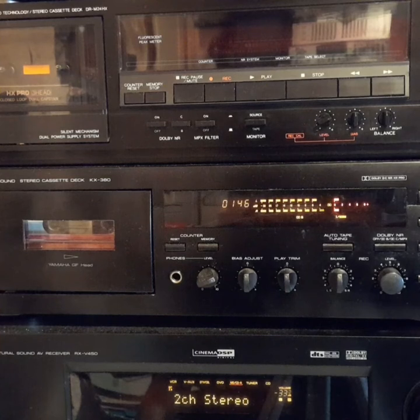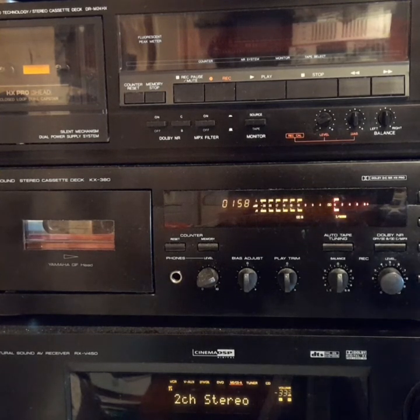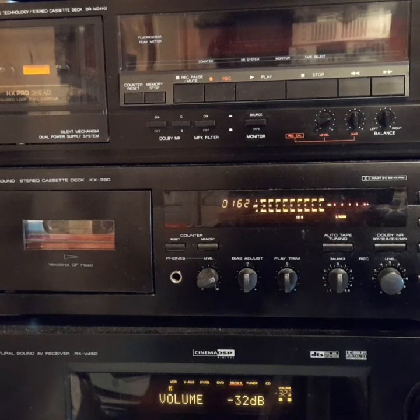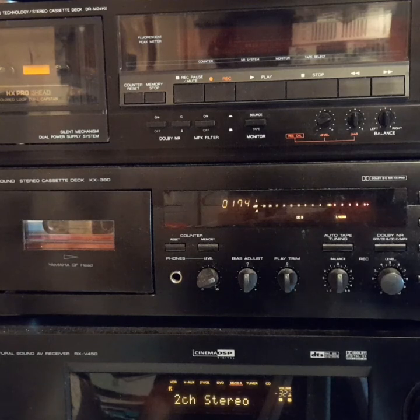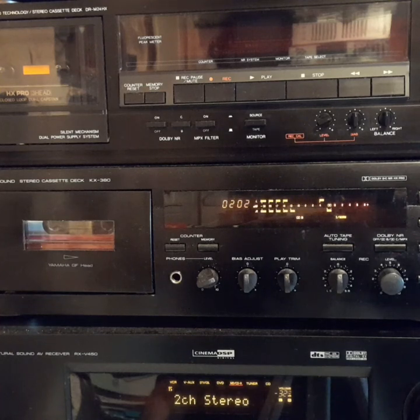This part of the test can also be used for checking channel separation. There should be little or no meter indication for the channel in which the tone is not recorded. And using your balance control as outlined in the notes, you can check the separation by ear. Lower your volume control now until both tones have been heard. Left channel. Right channel.